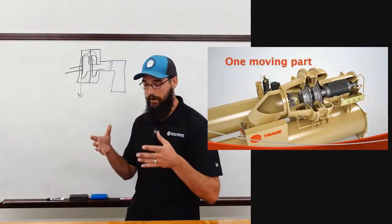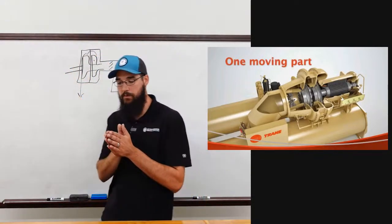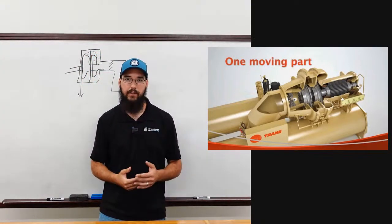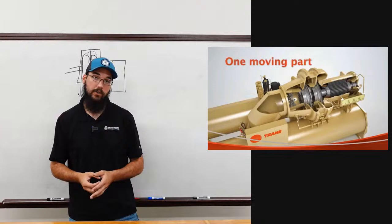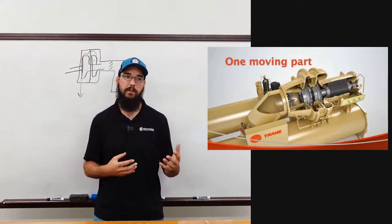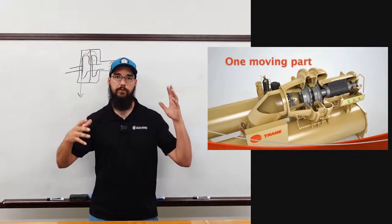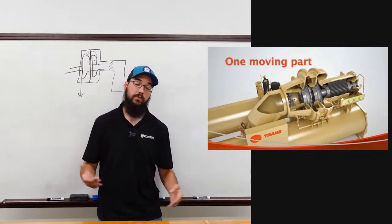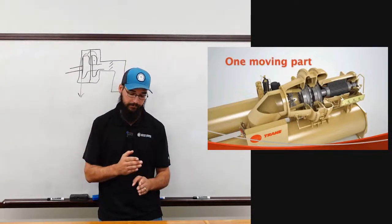And because they're running a very low speed with large impellers and multiple stages, they're able to carry that lift a lot better. Now, what causes higher lifts is if you have issues controlling your condenser water temperatures, keeping them low, or if you're running a low pressure machine, which would be, in today's standards, 123. There's a handful of other newer ones, I don't have them down by memory, but we do still have R11s in our area as well. So you're going to see all of the above.